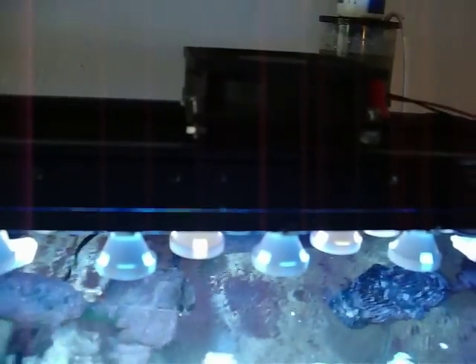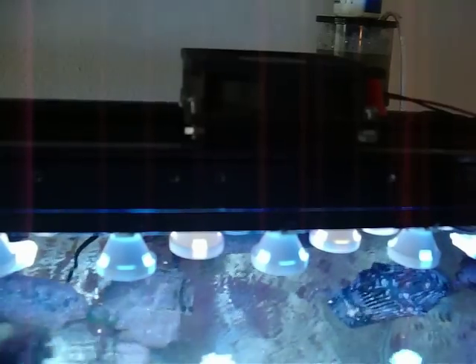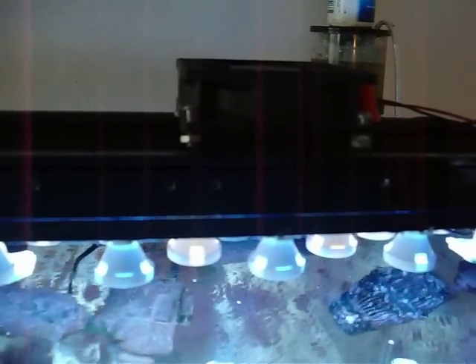Right here, I just got this LED mounted on this heat sink. There's a thermal compound that you can buy — I bought it off eBay. This thermal compound actually acts like glue; it's a two-part mix. When you mix them both together, it becomes very sticky and ends up just gluing the LEDs to the heat sink. On top I've got a fan keeping it cool.